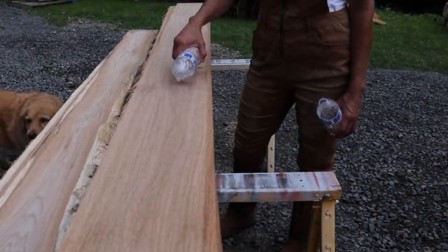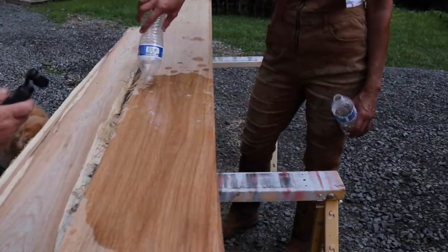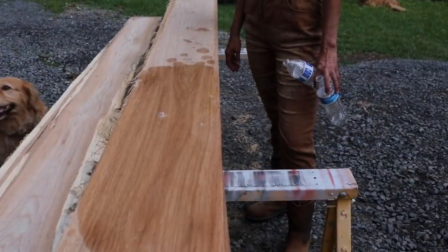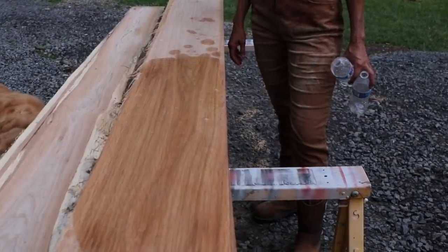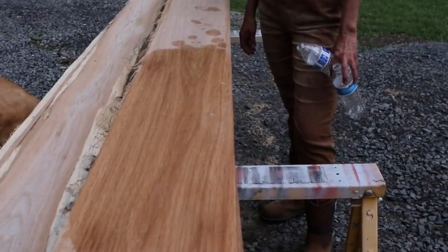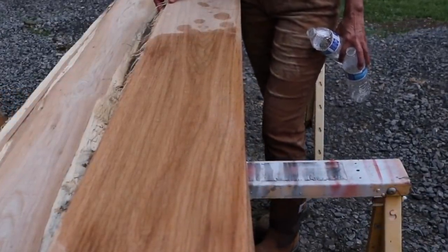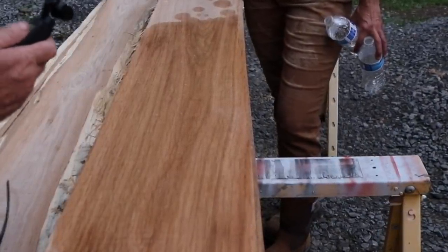And see what it looks like. It's a pretty nice white oak. So I was telling them at the beginning of this video, that log was ugly looking. All punky on the outside. It's been dead for years. What I need to do, when I take this up and sticker it, I'm curious, I'll put the moisture meter on it and see just how dry it is, because this thing's probably been dead for, I don't know, 10 years, but I guarantee it's still wet inside. Oh yeah, it is. Boy, that is pretty.